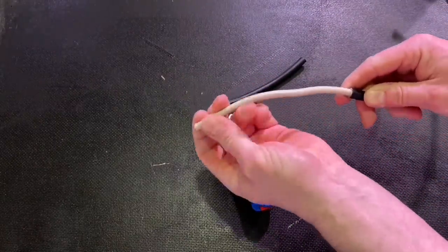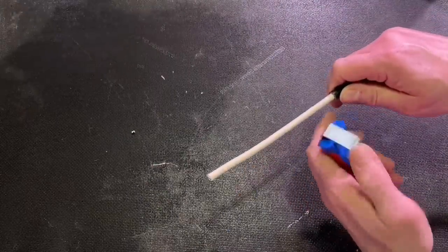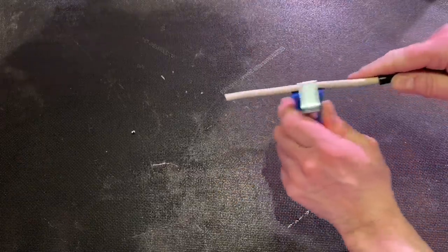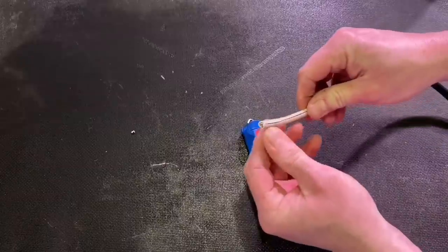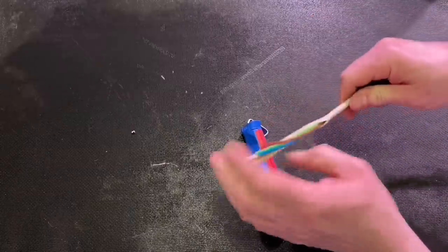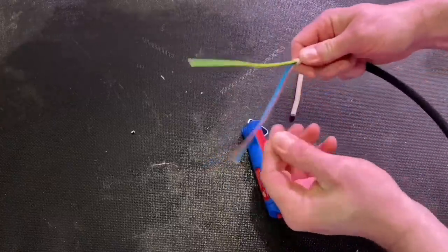I'm going to have an attempt to use it on the bedding. I'll need to adjust my blade in order to ring round for the second part — exactly the same technique. Pop it on, just get a little squeeze, round I go, and then straight down. That's taken the bedding material and split it nicely. Just pull — take that apart. And we're ready to terminate our tough sheath cable.